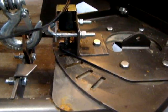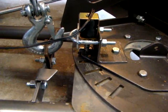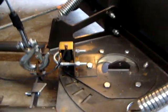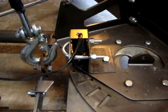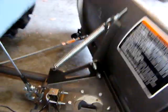You can see the pins engaged now. There's a spring on the solenoid that helps push the pin in when you come to a certain angle. The biggest problem is if you're not up against the stops like we are on this side, the pin doesn't easily go into the slot. We'll discuss that a little bit as we go on here.